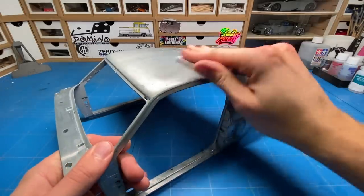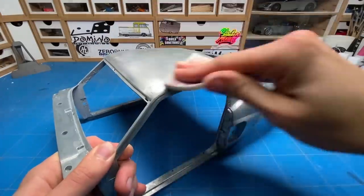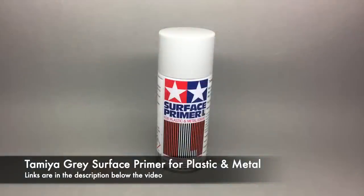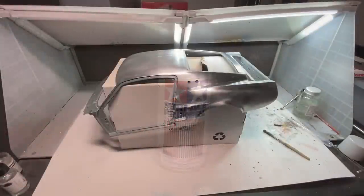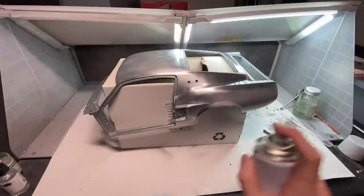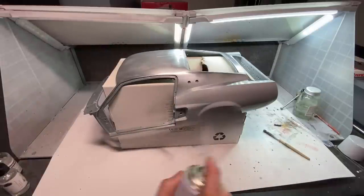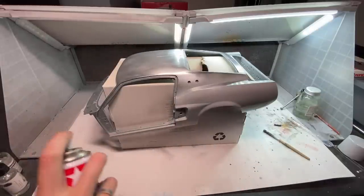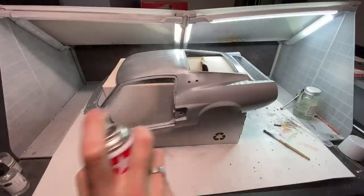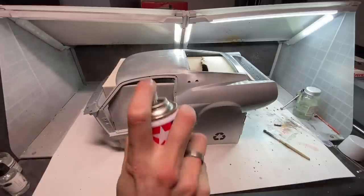Once all of the paint had been stripped off I moved on to prepping the metal for primer. I simply washed it off with some water and then sanded it down with a 400 grit sanding sponge. I then cleaned it off again with a wet paper towel to remove all of the metal shavings and generally clean it up. Once it had dried and was moisture free I moved it into the spray booth, placed it on top of a box since I didn't have anything else to hold the body, and moved on to applying the first coat of primer.